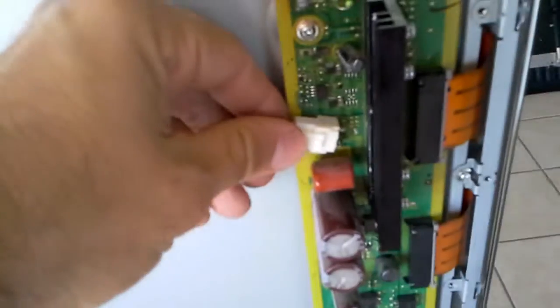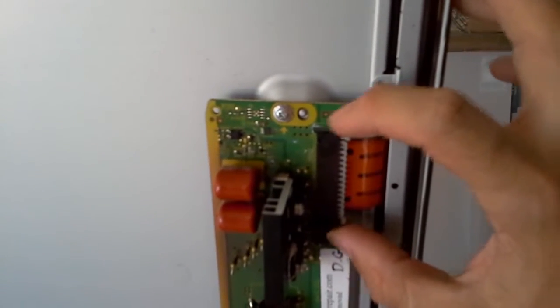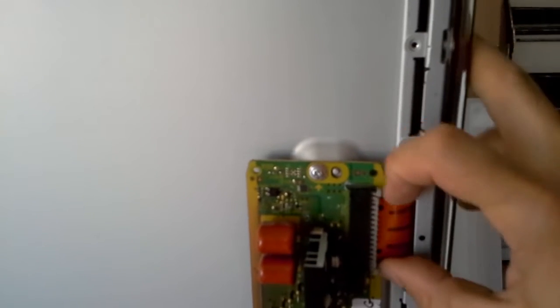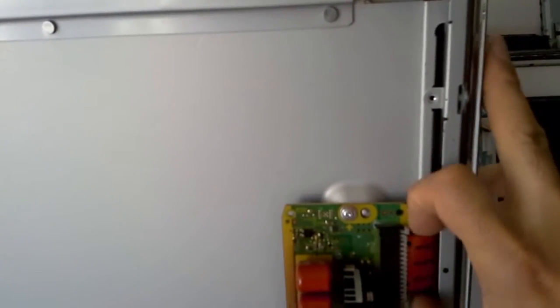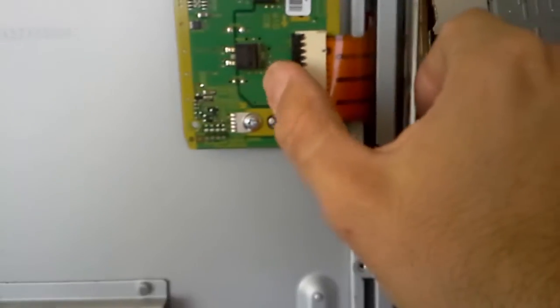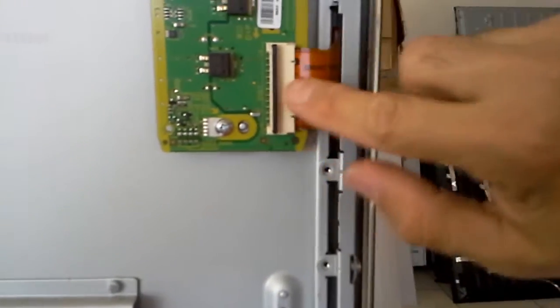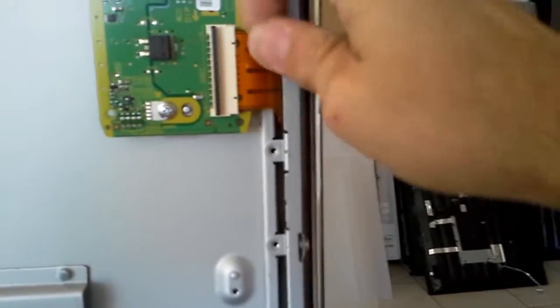To detach these, you press and pull — those are a little trickier if people haven't seen them before. Press the two ends together and pull sideways; this can be a little tricky. It's actually easier if the whole board is out with nothing holding it and those connectors are open. One connector is different — it opens with a flap on the back only. It's really the exact same connector doing the same role as the other three, but it didn't work mounted on the board itself.